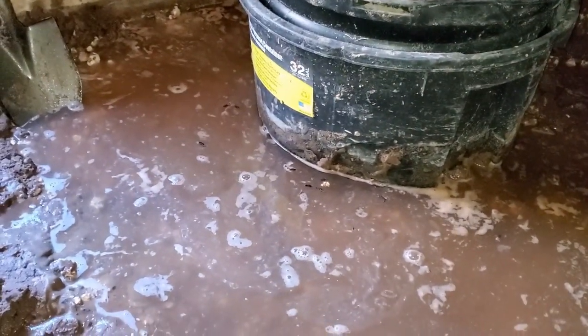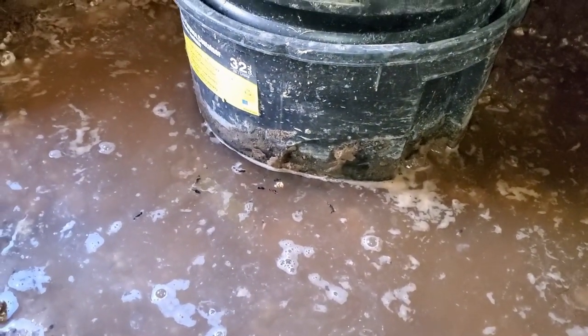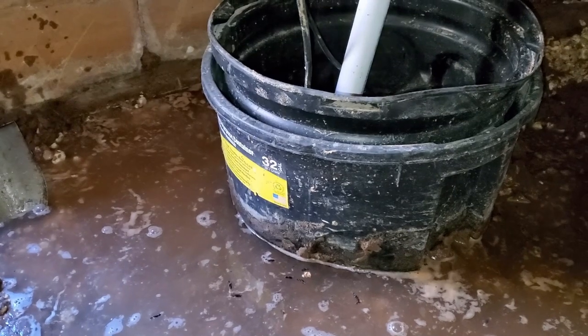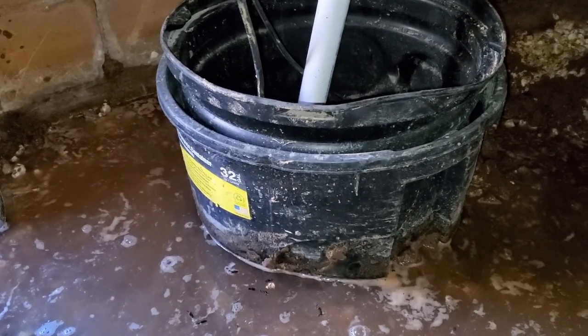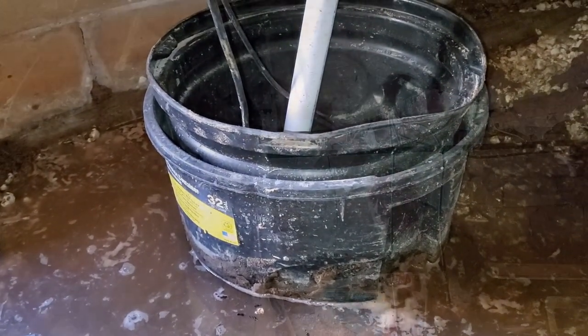It's looking real good. I just pulled a bucket out of there, but it looks like it's stopped — so that's the level of groundwater. You can see it's kind of getting muddy over here. We've got about eight more inches to go. We're going to run gravel all around this area so that it can perk into the sump basin. The footer tiles are already installed, so it's not that hard of a job, but something that needs to be done. Remember what happened: the sump pumps over a 40-year period or longer sucked all the soil out of this crawl space because they never put it in right to begin with — they didn't put it in the basin. It was just terrible when we got here.